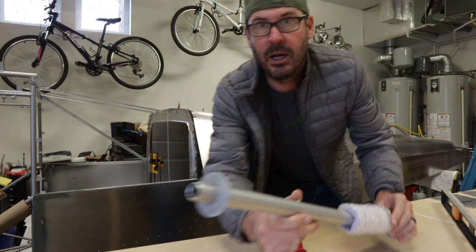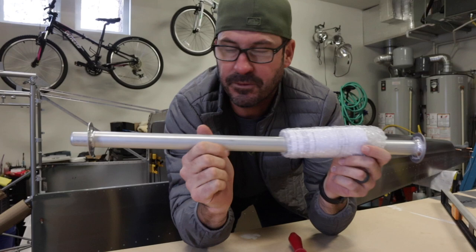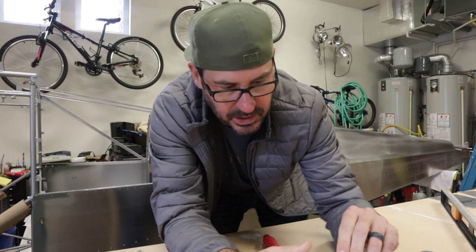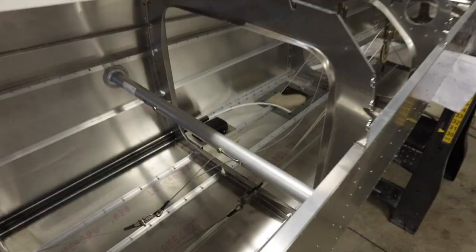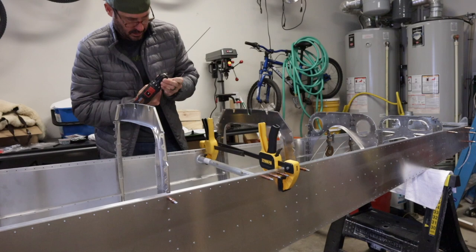Upgrades. So BAS Incorporated, Eatonville, Washington makes a Cessna tail dragger style pull handle. It's not listed on their website, but they do have these available at BAS — not sponsored. Let's check it out. I've got it located and marked up. Now that it's all located, I'm going to start match drilling size 40. That long drill bit is going to come in super handy.